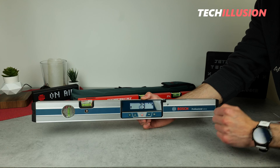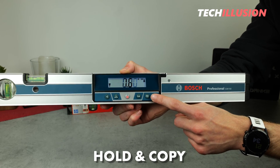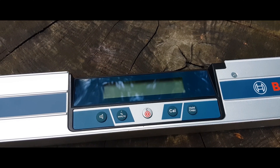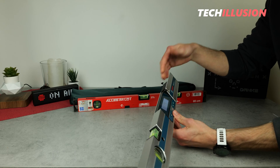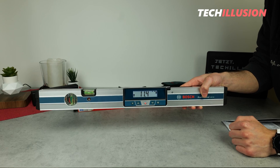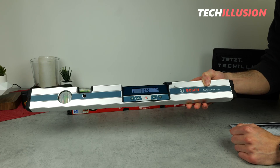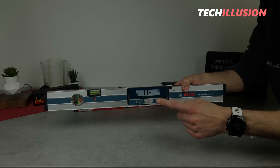On the other side, there are two additional buttons. First, the hold and copy button, which holds the measured value. If I place the device on a surface inclined at, say, 12 or 13 degrees and can't read the display correctly, I can press the hold button to save the current measured value and then read it accurately. From practical experience, no matter how good the inclinometer is, the display is not ideal — in terms of viewing angle stability, it's suboptimal. When I tilt the device slightly, the measured value becomes unreadable. Therefore, the hold button is used more frequently than one would think.